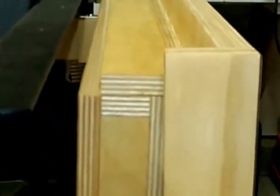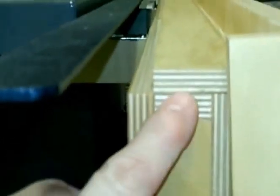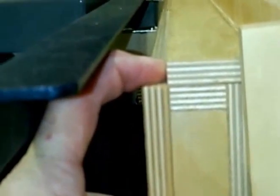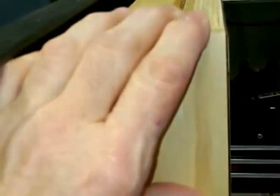Now I'll give you a closer view of this sleeve with it mounted on the table saw. As you can see right here, I have the half-inch birch plywood — three pieces — on how I got set on the end. I did it this way on the top portion for two reasons: one, it helps give me the little space I need for my rip fence, and at the same time by overlapping this joint right here and brad nailing down through the top with all the glue, it helps reinforce it so I don't have to worry about the weight of the outfeed table pulling the action.